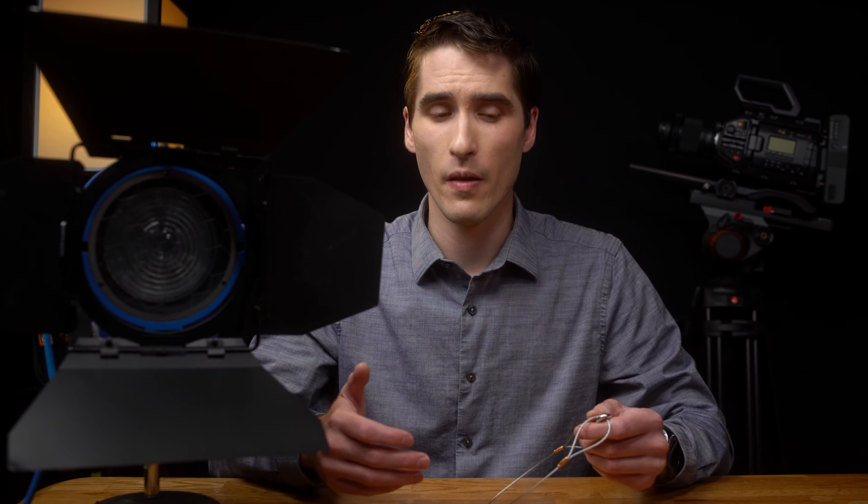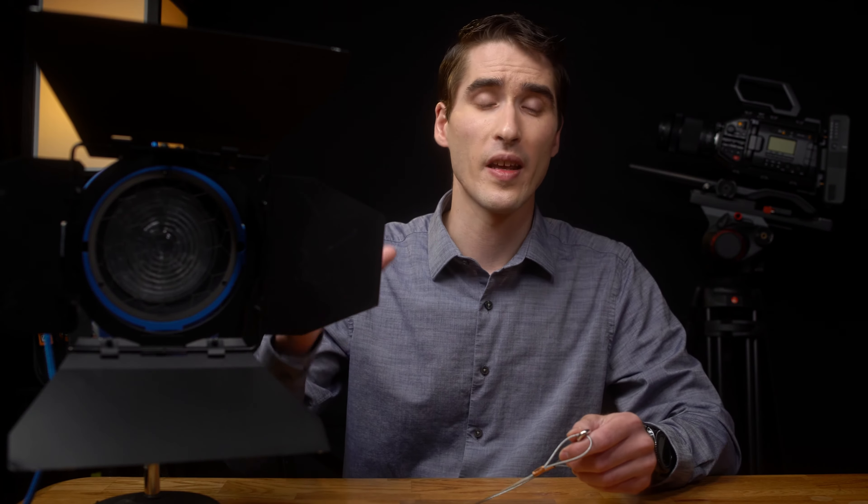Here's an actual light with the barn doors. One of the most basic places that safety cables are used is in securing barn doors to lights that are going to be above people's heads. Having the barn doors fall off and hit somebody in the head or the eye could cause serious, lifelong, or even fatal harm.